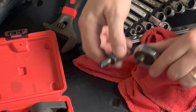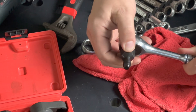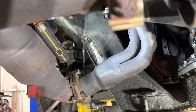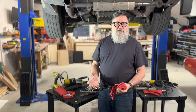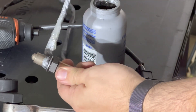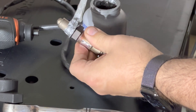I ran a chaser down the sensor port to make sure the threads were cleaned up as much as possible, and then I was able to get the new sensor in. It's a bit tight and I don't really like it, but it seems like it's as good as I'm going to get, as long as I can get it out again. This time I made sure to use lots of anti-seize — I think that's why it got stuck in the first place. I probably forgot to put any on last time I calibrated it. I won't forget that again.